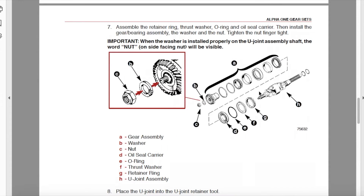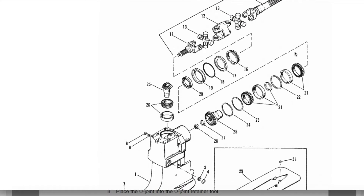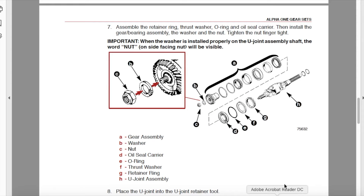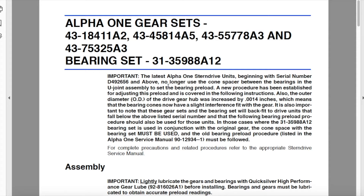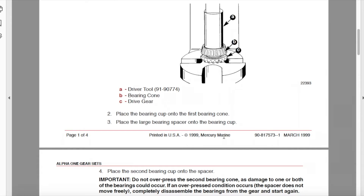Scrolling back to the old schematic: starting with the nut, washer, gear, shims, bearing, and bearing carrier — you can see the small cone ring, which is the spacer that has been removed from the new design. Then there is the larger spacer; it's actually smaller than the carriers themselves. That small spacer is not to be used on the new press fit design. Now switching to the new schematic — no small cone ring or spacer. The latest Alpha 1 stern drive units no longer use the cone spacer to set the bearing preload. Now let's go to the workstation to show you the actual gear sets — new press fit compared to the old slip fit.